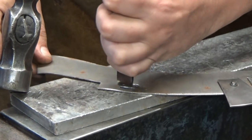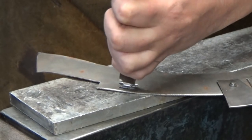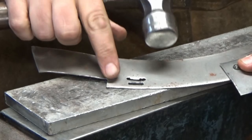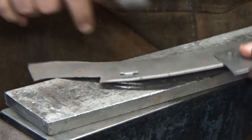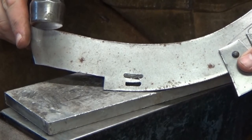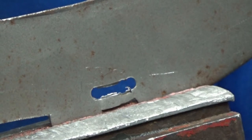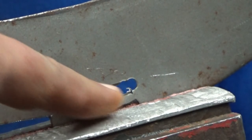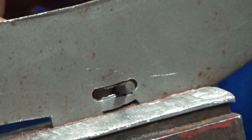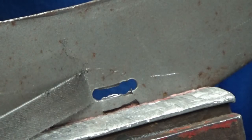Do the same again on the other side. There you go — in this case the piece has come out already. Sometimes you've just got to push it out. Now it looks quite messy when you compare it with the other one, but a quick file and it'll be operational. So we've marked our hole out, we've just got to get rid of this burr in there — our rivet can't even get through at the moment. We just need to take those down with our flat file and away we go.